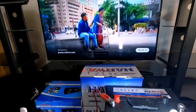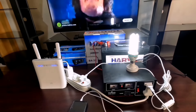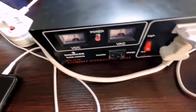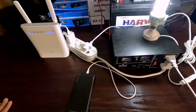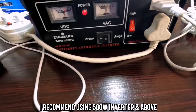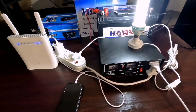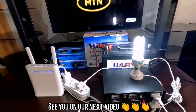Especially when it comes to load shedding — when you've got two-hour or three-hour load shedding — this kit here will run perfectly for you. I'll come again on the next video showing you how to use your solar equipment with different kinds and sizes of inverters. But in this kind of situation, I would recommend mainly using a 500 watt inverter compared to this 350 watt inverter — a 500 watt inverter will put out more power and work out much better. And obviously a thousand watt inverter, even better. So for now, cheers. Goodbye. Catch up on the next video.